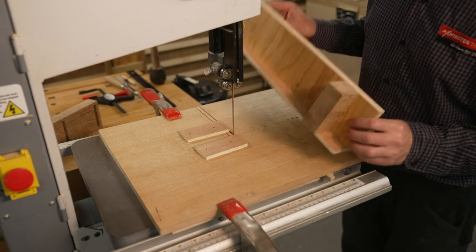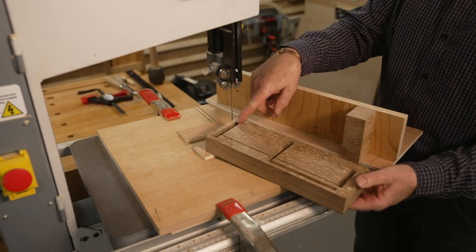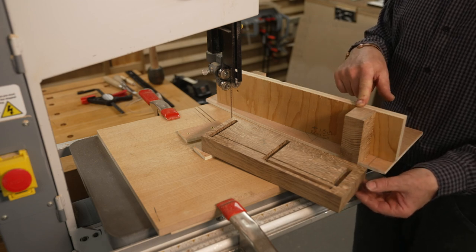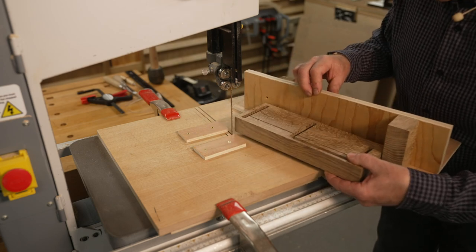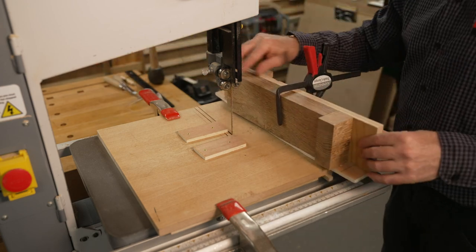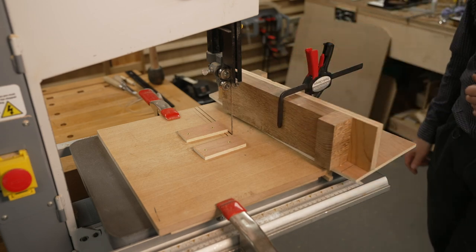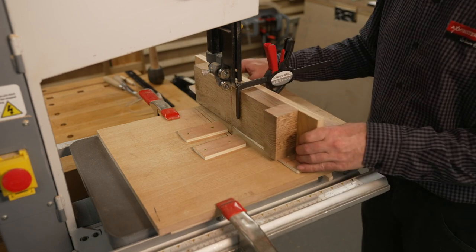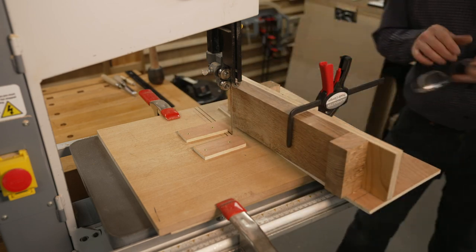So all we've done for the jig is some way to load the workpiece. So let's do that. Have a look. Got to make sure we've got the bottom at the base end down here. Nothing worse than getting this wrong now. So that's going to go into here. That way up. We want to hold it, stop things moving about too much, and it comes right back against the stop block down on the end. Clamp it up. This stage I can just do test bit where I can get into, check we're going to clear. I know I've got to move the clamp, so we've got to do that bit when we get going.